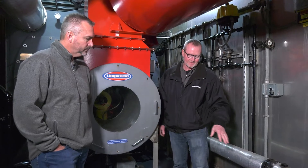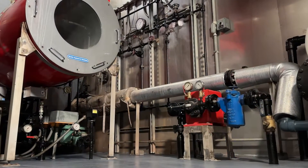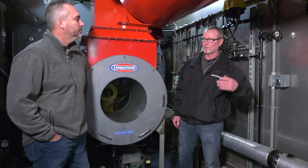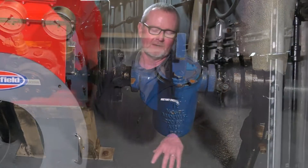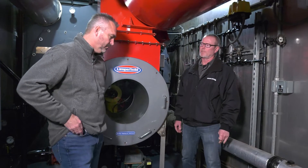The quickest way to tell is when they start the unit up, they'll record the suction that the pump is pulling — say two or three inches. If that starts going into the three to four inch range when you were running at two, you know you have a restriction; first thing to do is check the strainer. Also this time of year, if you're up north with real cold temperatures and an outdoor tank, that oil will gel. If it gets down to zero, five or ten below, it's going to start to gel and the pump can't pump it. You'll start having misfires. You can either put an additive in or heat the tank — a lot of them put a blanket around it.